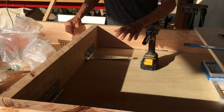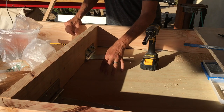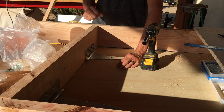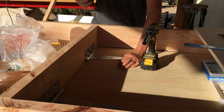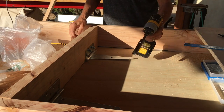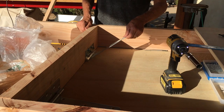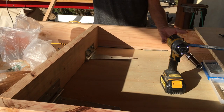Remember this is upside down. The Fitbike is going to fit upside down on top of this. This is an incline table — what we're trying to do is make it so that your rider, when you're fitting him, can be positioned while riding uphill out of the saddle, for example. So this whole table has to tilt. These gate hinges are acting as our pivot. When this is bolted on here, it will pivot like this — this side comes down, which means this side goes up.